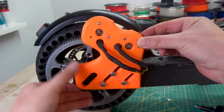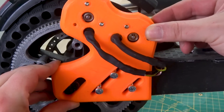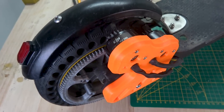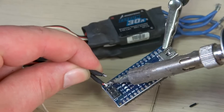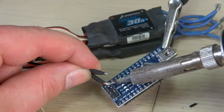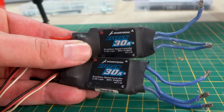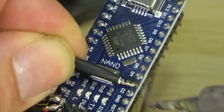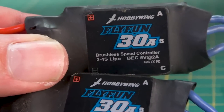To be able to use the same motor mount for all tests I designed the mounting holes as slots so it can easily be adjusted for the different gears we are about to try. With the motors in place and the gears mounted, the last thing we need to do is connect the electronics. The electronics consist of 2 electronic speed controllers, or ESCs for short, and an Arduino to convert the throttle's analog signal into a digital signal for the ESCs.